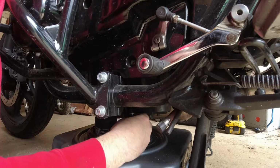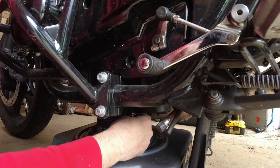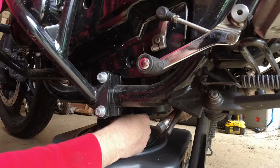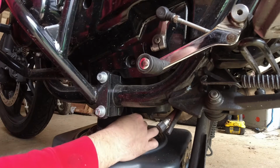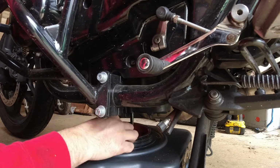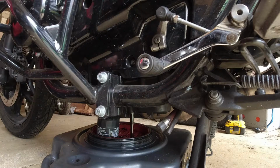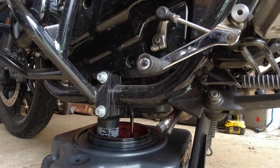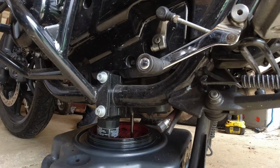Being an air-cooled bike, this relies entirely on oil for cooling it, so it has quite a large oil capacity, almost 5 quarts, which I will now dump much more cleanly into that pan than I thought I would. This oil has barely 3,000 miles on it, slightly over, but it's the beginning of the season, so we're going to do it anyway.